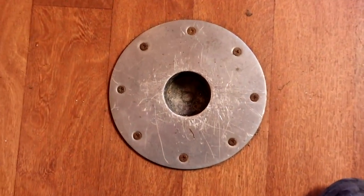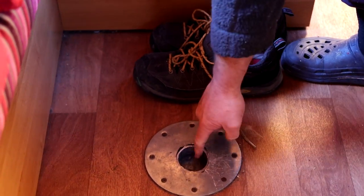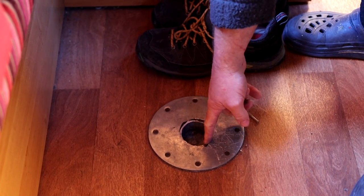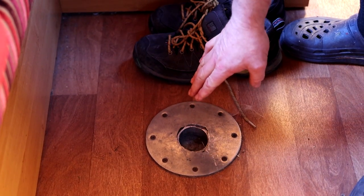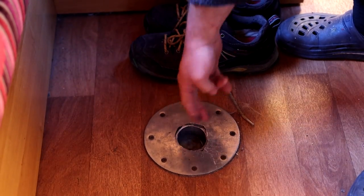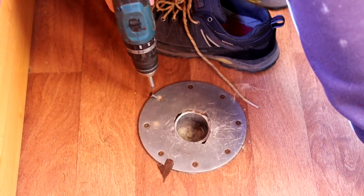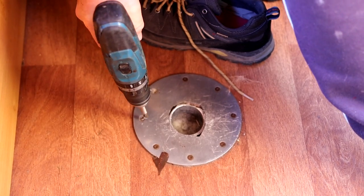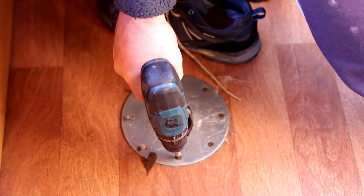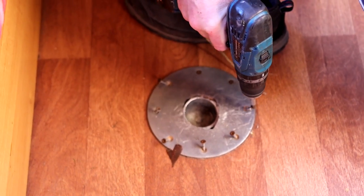At the moment, no. I think a lot of the problem is, if you look, you can't move it at the moment, but there's about 5 mil of nothing underneath this. So the weight of this was just being pulled on this metal, and it's called fatigue. But I'm going to put some packing underneath before I put the new one in, to make sure it doesn't happen again. Usually always one screw that doesn't come out.